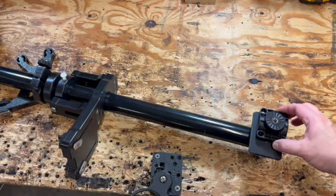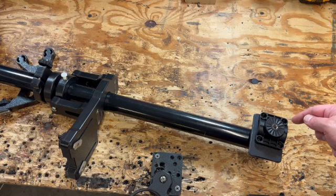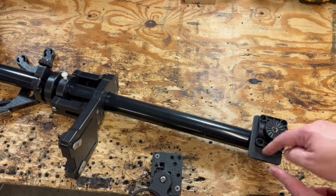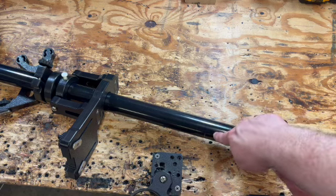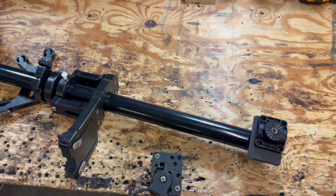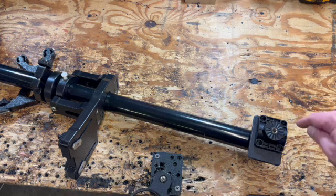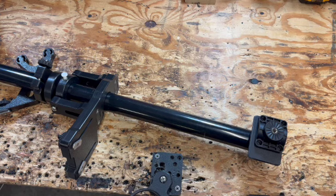So let's get into mounting the transducer piece. I want to put it on the bottom right of this particular plate. The reason is when you mount your transducer, your transducer is going to be roughly that big, and that's where your wire comes up. You've got to design it so your wire is going into the pipe or you're zip-tying the wire and feeding that line back through the post — we'll talk about that in just a second. That's why I want to mount it there. So I'm going to go ahead and drill my holes, put my bolts through, and get it all installed.